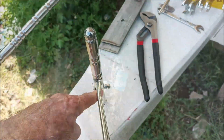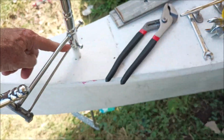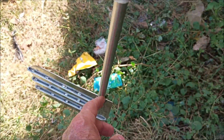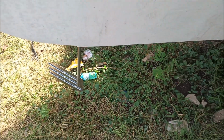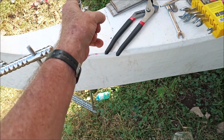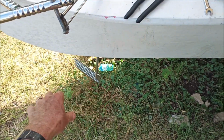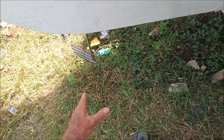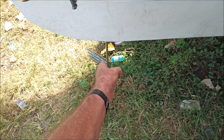The shaft here is I think 5/8 inch, solid stainless steel, 304 stainless. So I think the shaft is going to handle it. You can bend that shaft. I can bend that shaft, if I put it on my knee and I have a long enough piece from here to down there and pull it, you can bend that 1/2 inch stainless. But at 30 degrees, we shouldn't be stressing it like that.